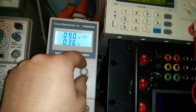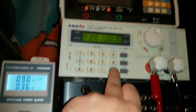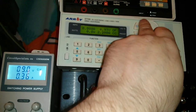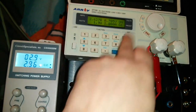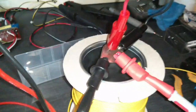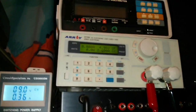It probably wants something a bit more significant to be able to deliver its full load. This is not a particularly clever idea giving it nine volts, but what we'll do is give it a quick blast at two amps and see what happens. There you go - 4.8 volts. It was able to regulate a lot better with a bit higher input. So we'll give it a full three amps and see what happens. We'll crank it down a bit - 2.8. 2.6 - we're at 4.82. So we managed to get 2.6 amps out with a nine volt input and about four and a half volt output.